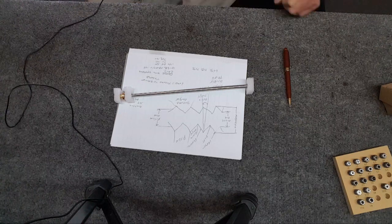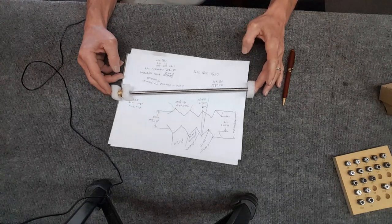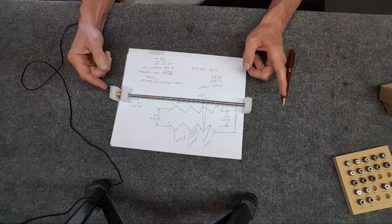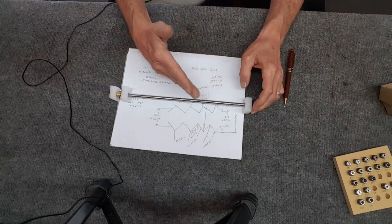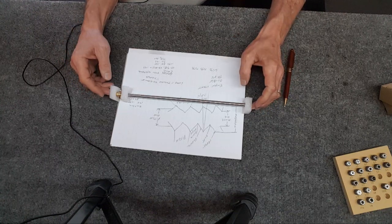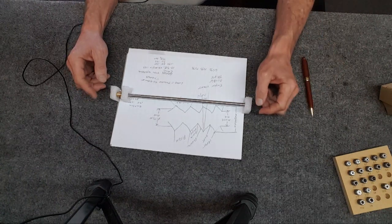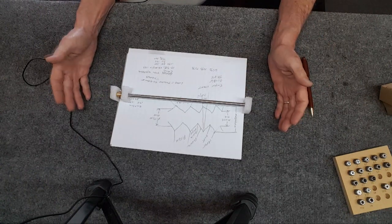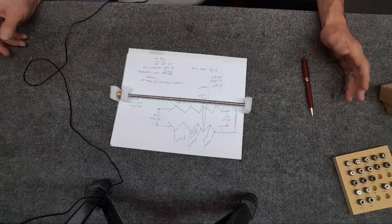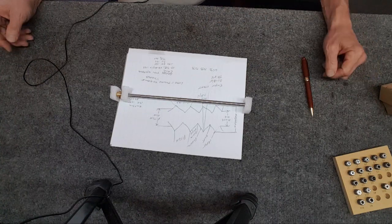So the bottom line is, if you're going to play with lead screws, there's a lot of variables involved, particularly the helix angle, the angle of the threads. This is the third one from Amazon that hasn't been returned yet. The other two are gone. It clearly states 8mm, perfect. It clearly states 2mm pitch, perfect. Does not tell you what the helix angle is.